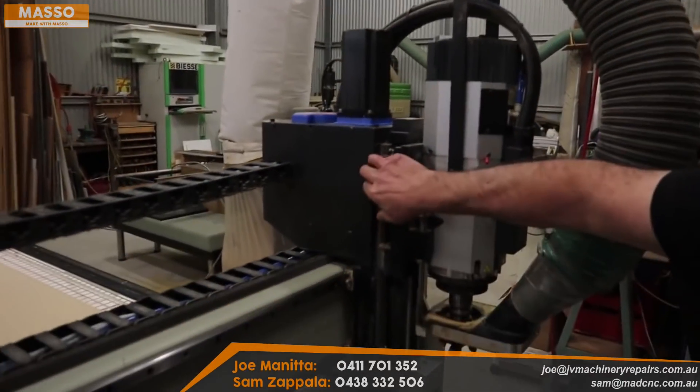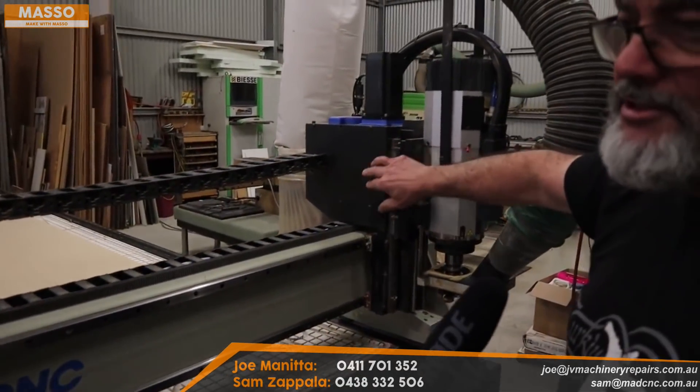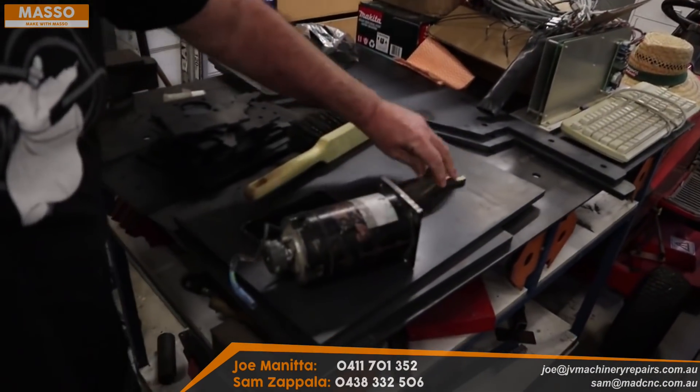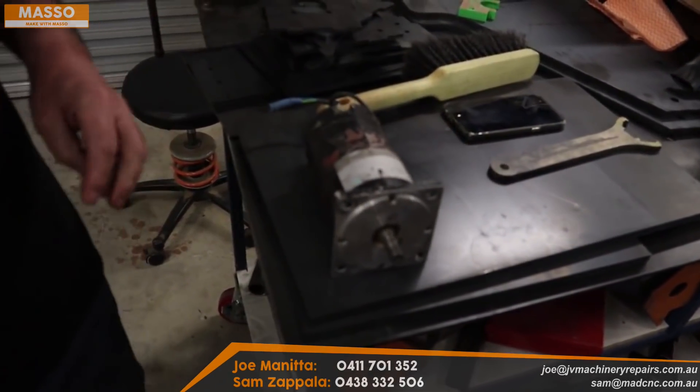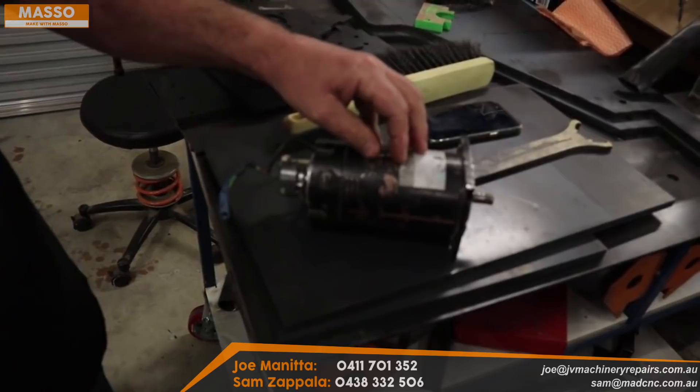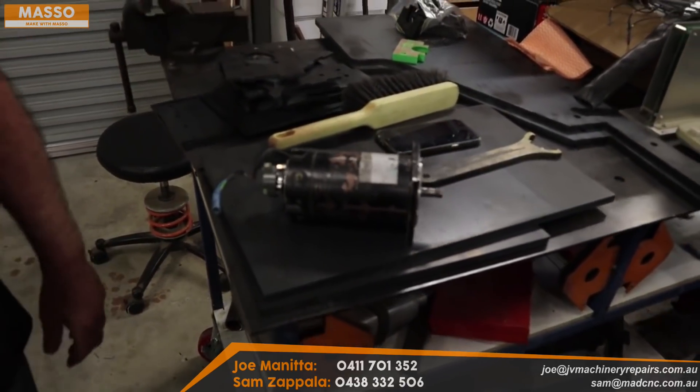As you can see up here, these couple of blue things — I 3D printed those parts. I had to modify a couple of shafts on the motors and the pulleys to make everything fit, because they weren't the same as the original motors. That over there is one of the original motors — an old brushed DC servo motor. It still works, but nothing talks to them anymore. The hybrid stepper motors are much more reliable, very strong, very powerful. The 12 newton metre ones are probably too powerful for what I need — I believe the original motors were only about four newton metre capacity.